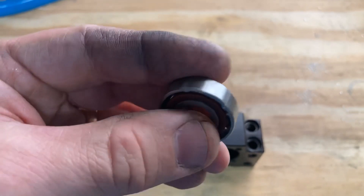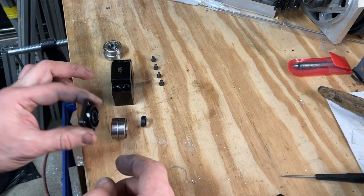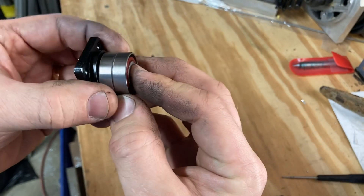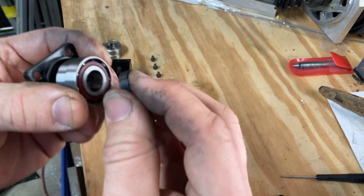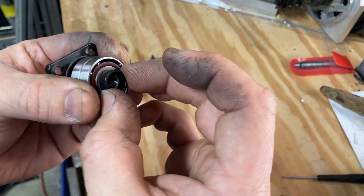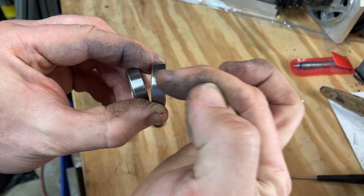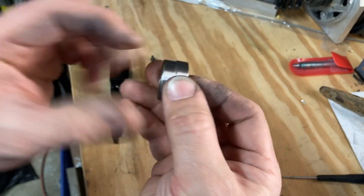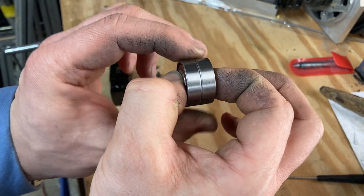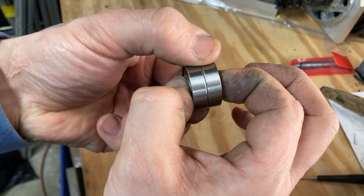I'm going to try to upgrade my CNC machine. By looking at this setup, it seems the system is built so that by squeezing the nut on the ball screw, we squeeze the inner races together with these collars. I have to put these bearings facing each other so the axial load is handled in this direction — two bearings facing each other. But when I squeeze the two inner races together, I still have play in the outer races, and that's not what we want.